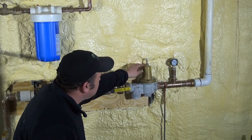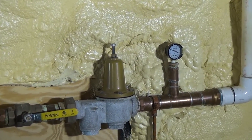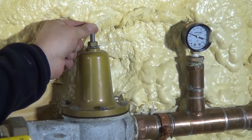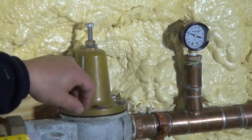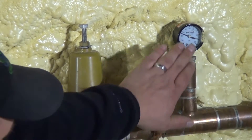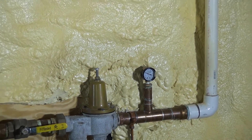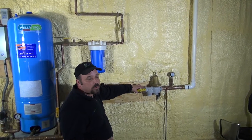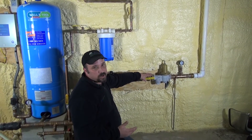To adjust this, if your gauge shows pressure higher than 30 pounds, you would loosen the screw and turn it clockwise or counterclockwise depending on whether you want to raise or lower the pressure, and you'll see the pressure start to drop or raise. You want to bring it to that 25 to 30 pound range, and from this point the supply goes out to your geothermal heat pump. What's nice about the pressure reducing valve is it sustains that lower pressure even when your domestic water is in use, so your household water remains at 50 to 60 PSI while your geothermal system maintains 25 to 30 PSI.